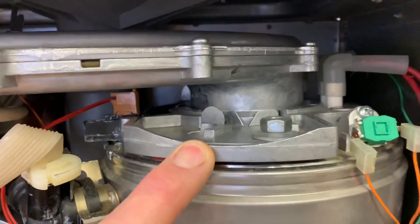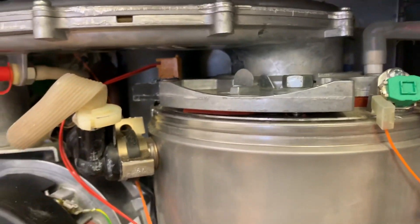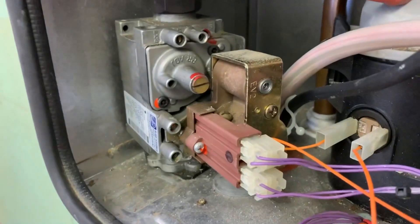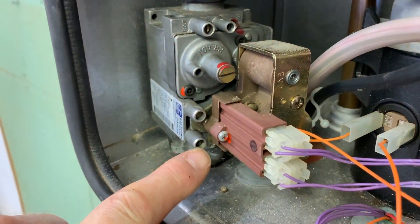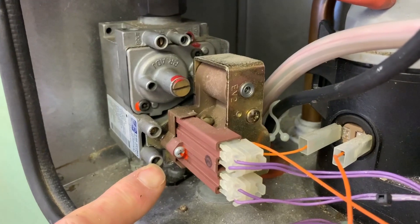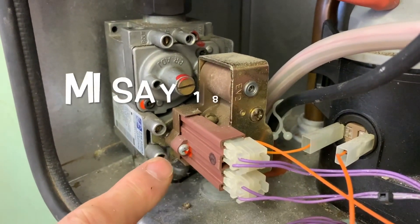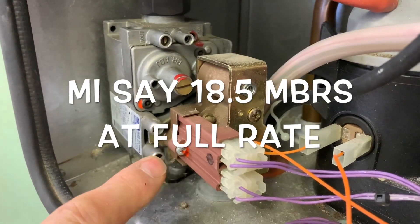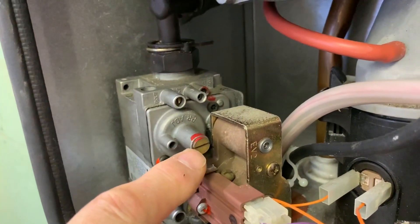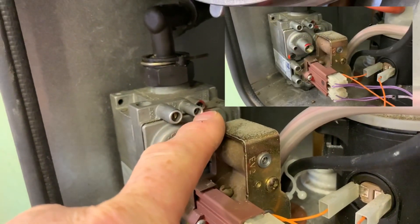On the top of the burner, we're going to look at that more closely and go through how we remove everything so you can see inside how it works. Coming back down, we can see our gas valve. This point here is our inlet test pressure — Worcester say your inlet test pressure must be no more than a 2 mbar difference to your working pressure at the meter. It's slightly different to other boilers because the test nipple is on the gas valve, not on the inlet of the pipework. This here is our minimum for flue gas analysing and that little one is for maximum.